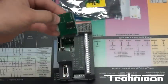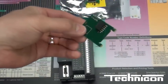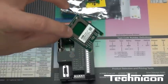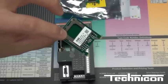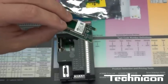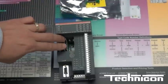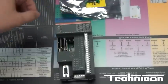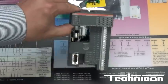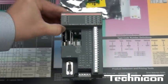The first card I have is the SD card slot. I'm adding the SD card slot — it's a nice feature. The SD card can be used for data storage. It can also be used to house the program in the fully compiled and uncompiled versions as a backup, and it can also be used for flash writes to the BIOS of the PLC. You saw how simple that slid in — it's just a quick connection in there, and you can see inside the PLC.